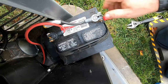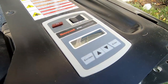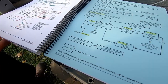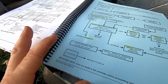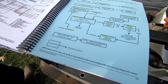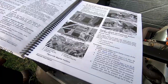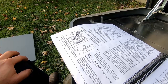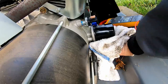Looks like oil got a little bit everywhere in here. We have a Sync controller here — Sync is the same thing as Nexus and Evolution. These are not the most user-friendly books in the world, but under Troubleshooting Flow Charts we find: shutdown alarm during crank or run — Test 61, check oil pressure switch and wire 86. Normal operating pressure is 35 to 40 PSI, and ours is higher than that. The layout of this manual could be better, but they want you to go into the digital section and check that it switches from a 1 to a 0.